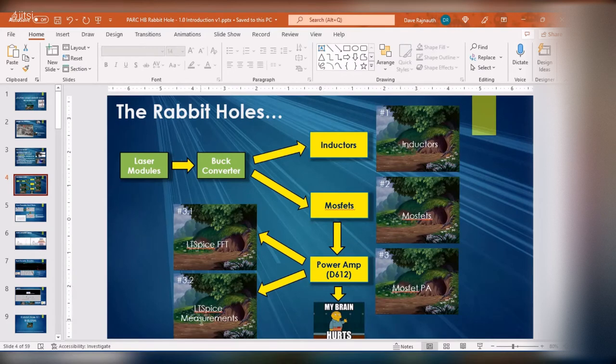As I was doing that, it led me down two additional rabbit holes. To look at the purity of the power amp, I had to do an FFT in LTSpice. I thought I knew how to do an FFT in LTSpice, but I didn't know jack — it's fairly complex. So I had to go back to first principles for FFT and refresh my memory. The other powerful piece was using LTSpice measurements to automate your measurements, because going and measuring the peak-to-peak voltage for each amp manually is nonsense. There are ways to automate measurements, run formulas, and characterize various power amps.